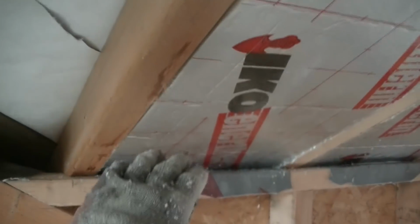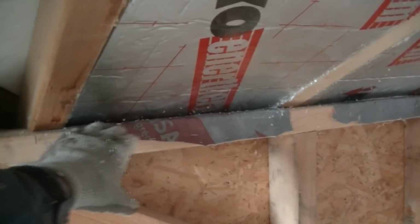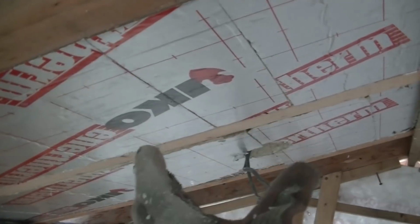So like I said, I've been doing this angle, getting a short piece of board in there, then I do this one, push it back as far as I can get it, sit it flush down there on the wall plate, I got it nicely in line, then you end up with this slot here. And then that means you can just put a nice little sort of briquette, if you like, just a rectangular piece of insulation board, and just slot that in.